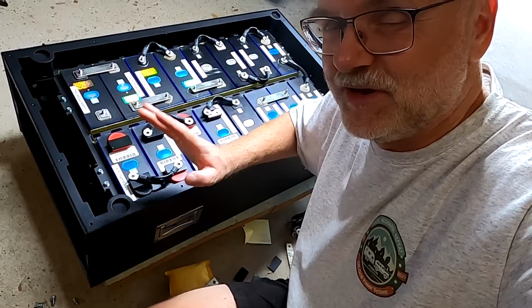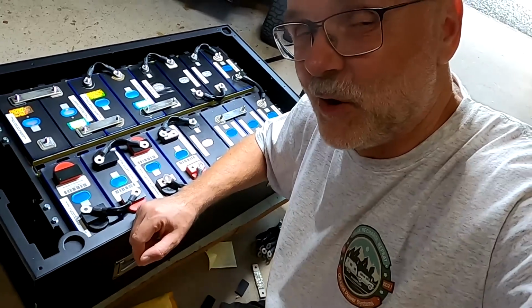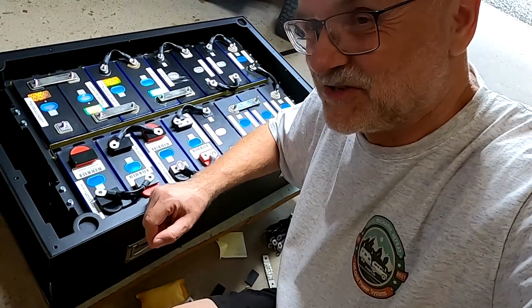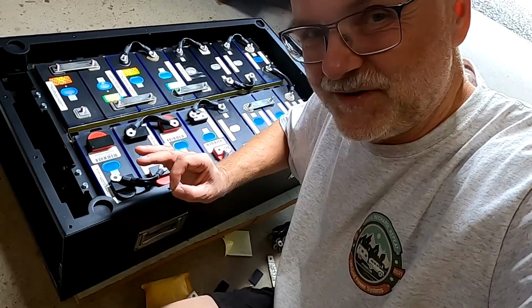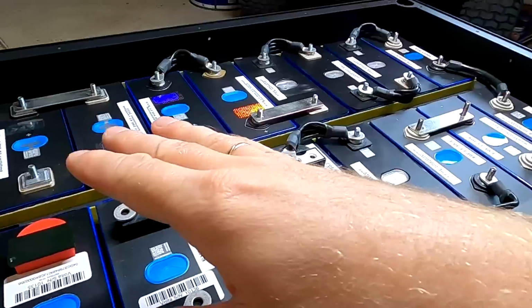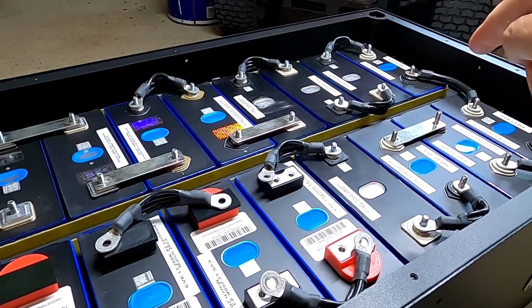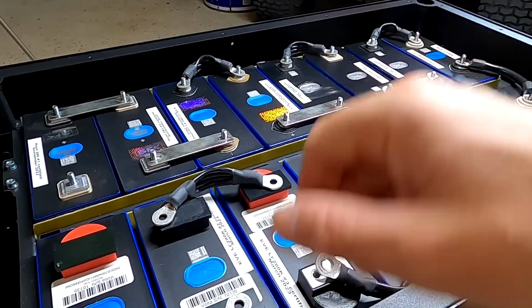Anyway, guys, I want to keep the videos a bit shorter, as I said, because I want to get your feedback on this one here. So let me know in the comments down below what you think about the Frankenstein battery. Fully compressed here. I hope it all goes well. And in the next video, I want to connect the BMS to this battery here, and then we can already have a view on these individual cells. I have pre-charged all the cells to 3.45 volts, but not in parallel. This were all separate. So they should have roughly the same state of charge, but there could be still a lot of balancing happening as well.